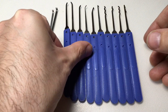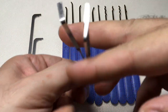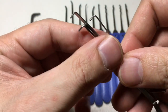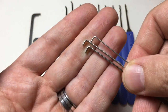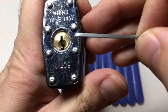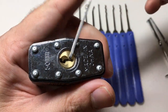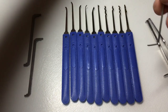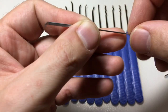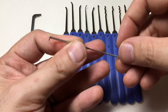Let's have a quick look at the tension tools. You get three different thicknesses of tension tool that fit away from the pins. What's really nice is that they have a Z-profile with a smaller hook at the end, which is very good for going top of the keyway. Here's a standard American-style lock — you can get tension by putting the smaller hook at the top and use top-of-the-keyway tension this way too. The finish of these is good, however I do think this end is probably two millimeters too long, and both ends are a little bit sharp — but that's extremely easily remedied with a small finger file and a little sandpaper.